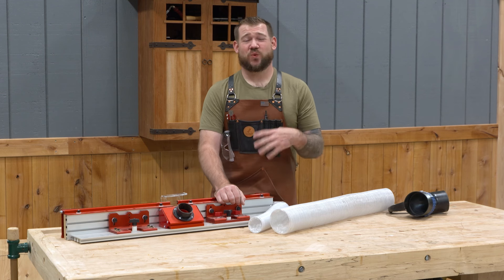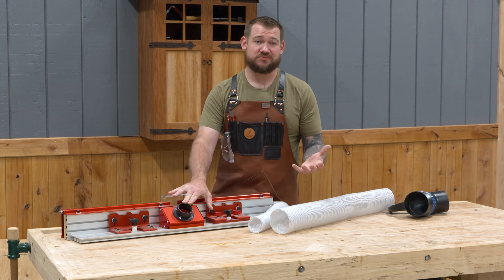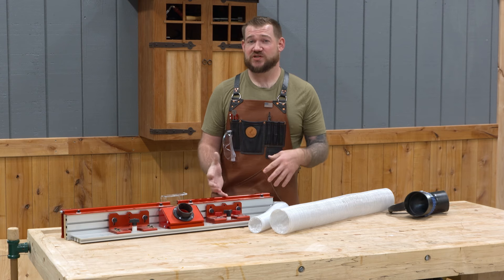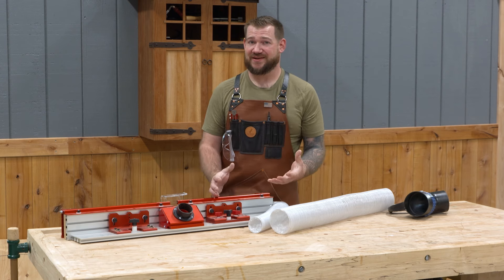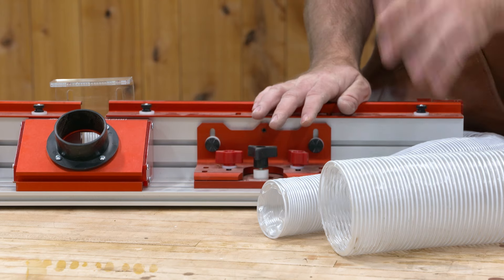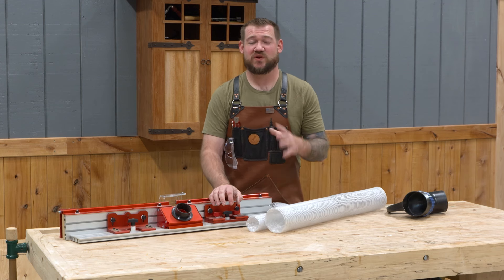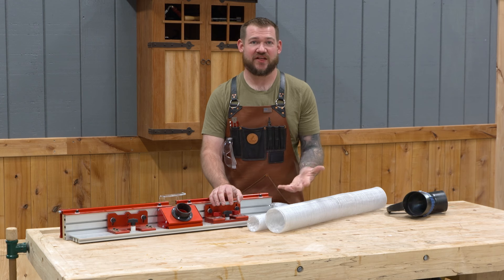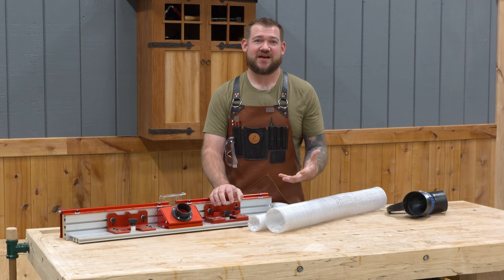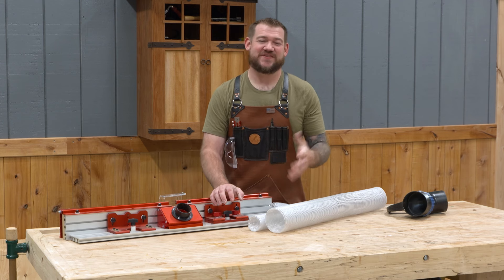So the Supercell works really well when you're dealing with a mixture of two-and-a-half-inch and four-inch ports. For most of us working in garage shops or small commercial operations where there's one or two people in the shop at a time and maybe two or three blast gates open at once, it's a great solution. The high static pressure and high CFM is really what makes the Supercell different from other dust collectors. Let's head back over to the unit, look at its parts, how it functions, and the configurations it comes in to see if it's right for your shop.